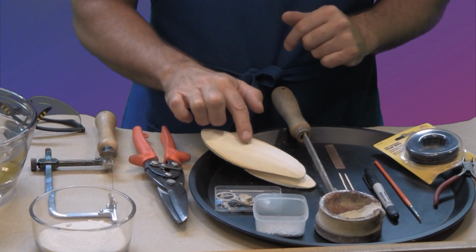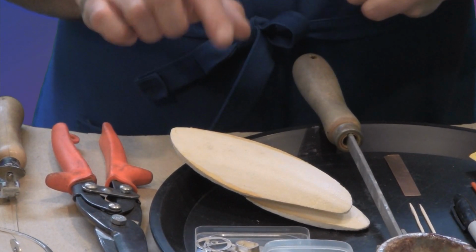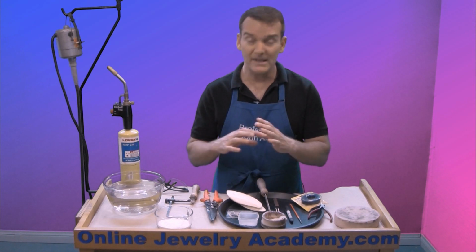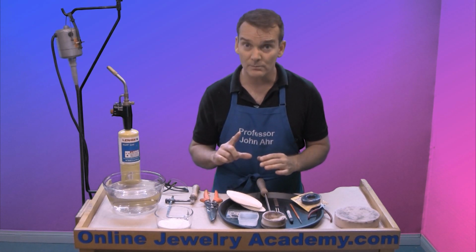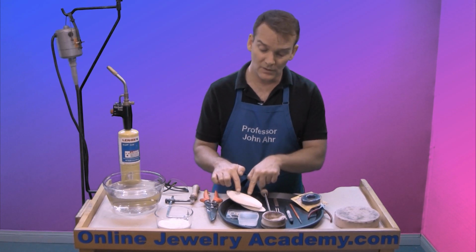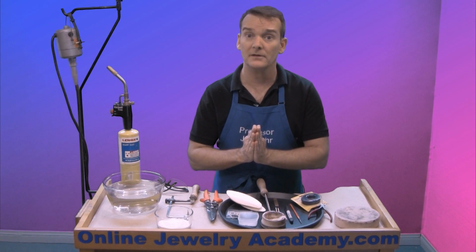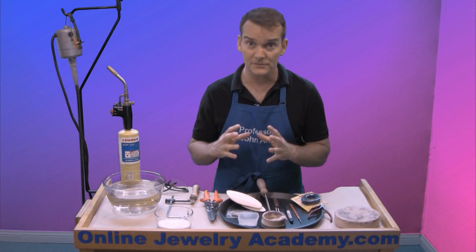Okay, you're also going to need cuttlefish bones. Now, if you are lucky, you'll get a big one and you can use just one bone per casting. If you can't get the big ones, you can go to a pet store and probably get this size and you can marry two of them together in order to make a large enough cuttlefish mold.